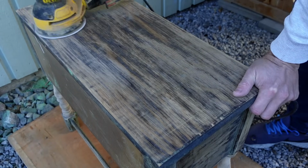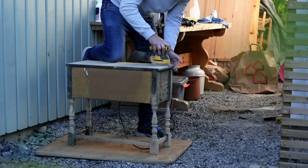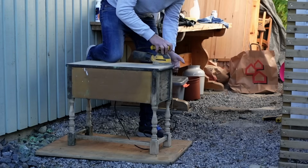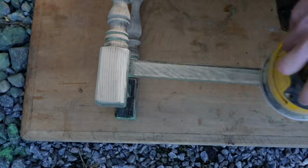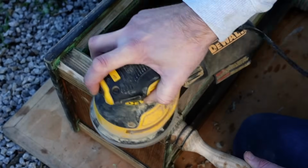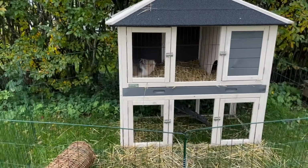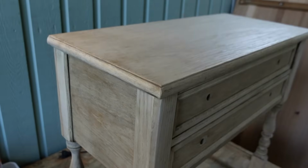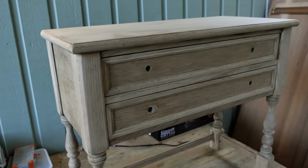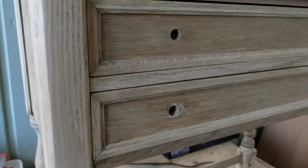After working with those legs for hours, this flat top was like a dream to work with. So I did some gentle sanding with 220 grit sandpaper, because it's veneer, so you don't want to ruin it. After seeing how great the wood turned out after the sanding and stripping part, I decided not to stain it. Instead, I think I will just add some satin spray lacquer to it. That will be enough.